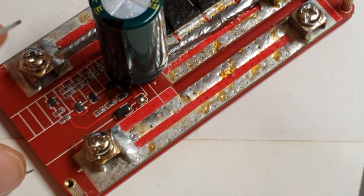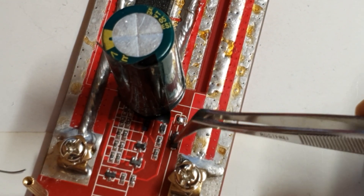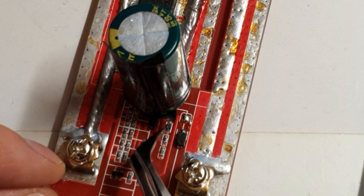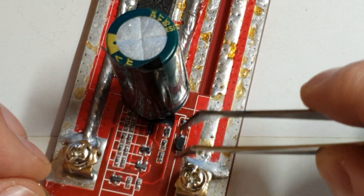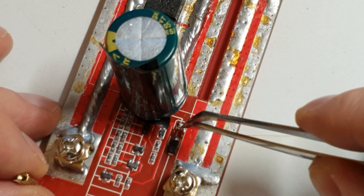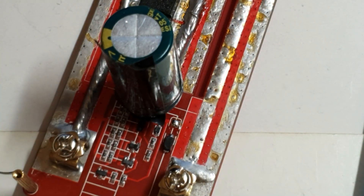That's the first part — simply turning it around. Now, what's left to do is solder a resistor from this end all the way to the other side here — that's a series connection. Many people thought I was soldering it in parallel, but this is what you have to do. You can do it other ways — cut a track or whatever — but I found this the least invasive way.